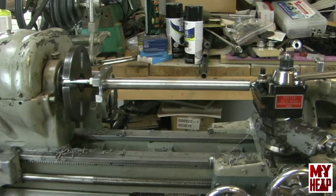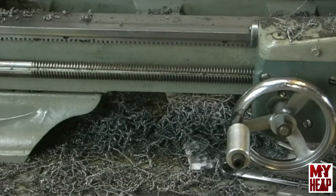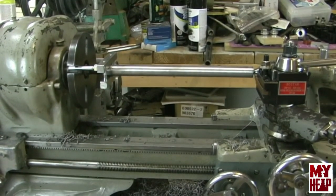The suggestions that Art and Jeremy have given me have been very helpful in getting closer. The next thing I want to do — when I get a little free time during the week — is continue making chips. And look down here, I've made some chips! Not bad for an old computer geek who's never run a lathe. The next YouTube Shop Student video I want to machine the back plate of my four-jaw chuck. Machining the back plate doesn't matter if the tailstock is in alignment or not, since it won't be used between centers, but there are some measurements I want to cover in that next video.